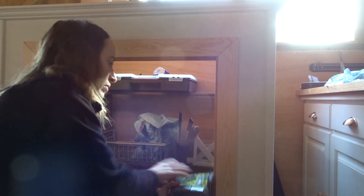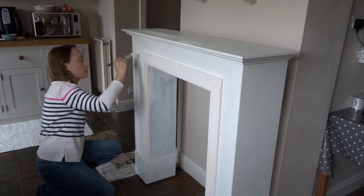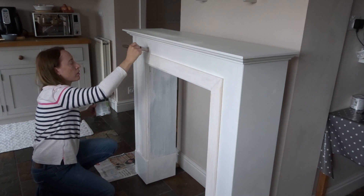I considered adding a new top to the fireplace but decided against it since I already had quite a lot of height from the plinth. The proportions felt right. I then painted the fireplace — a little bit of caulking and filling first — and painted it white, the same colour I use throughout my house on skirting boards and doors. A good tip: always use the same white paint throughout so touching up is quick and easy.